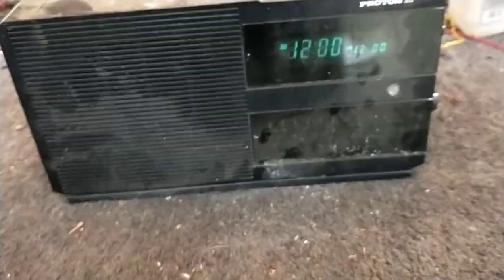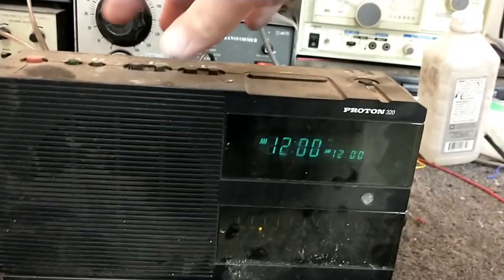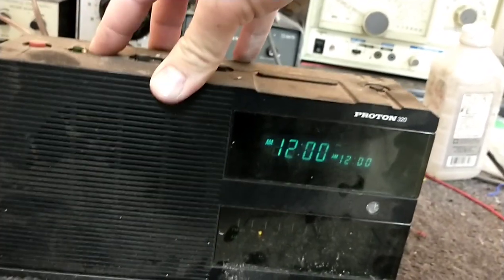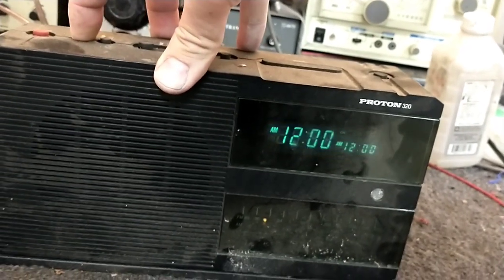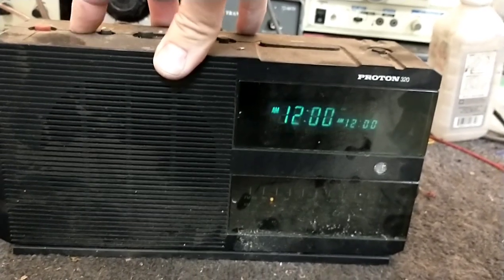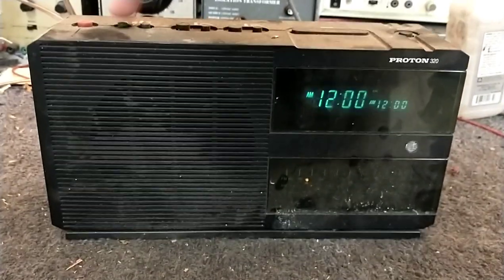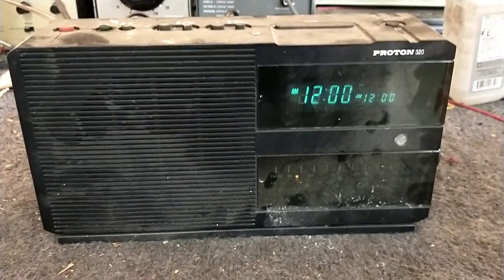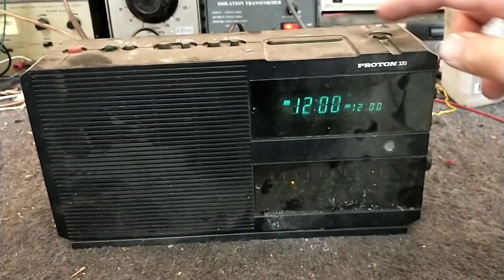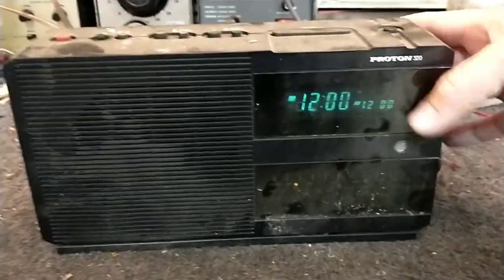Just a moment while I do that. So we have a display, and if I turn it on, it's very slow to respond, if at all. The last time I powered it up it was responsive, but now it's really not. That has to do with caps in the logic circuit, which pee and cause disruption. You can pretty much do anything you want and it won't respond.